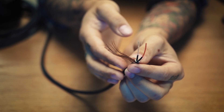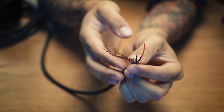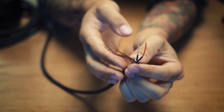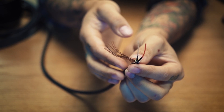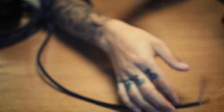This is why you want to use balanced cable in a studio or live environment where you mix a lot of electrical and audio cables. Especially if you run long lengths of cable — the longer they are, the more noise they'll pick up. With a balanced cable you can run a really long signal path without any noise getting through. The only thing that may happen is some signal quality loss due to very long cable runs, but that's a totally different issue.